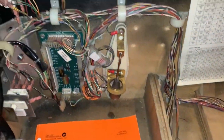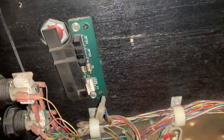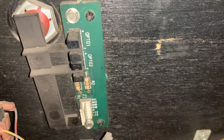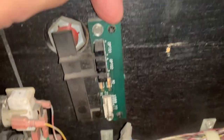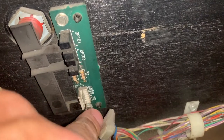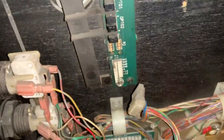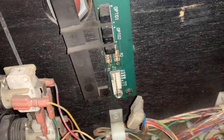All right, so the playfield's lifted up. Looking on the left-hand side, this is the inside of the flipper button. As you strike it, you can see the interrupters that break the beams and open the beams up to opto one and opto two. This is the board I'm gonna pull off. I've already disconnected the wire here. It's just this connector, and then there's a quarter inch screw here and there. So I'll pull it off. It already looks kind of dusty, so who knows? Maybe I just have dirty optos. Yeah, it's a little dusty. We'll take a look.